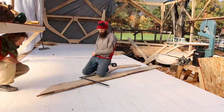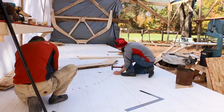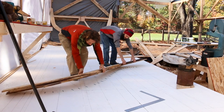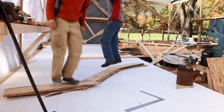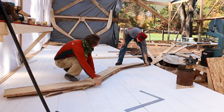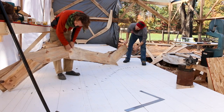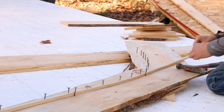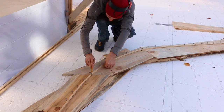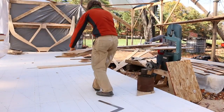There are many ways to construct the mold, but a solid lamination glued and screwed together worked well for us. Be sure to leave enough material inside of your line once cut to have a sturdy mold. After having a solid construction, flip it and start hammering the heads of roofing nails along the line to be transferred — the same technique used to make patterns for the backbone timbers. A nail in each transfer mark will then allow you to spring a batten to mark your line. Use the stiffest batten that will take the curve; for sharper curves an old bandsaw blade worked really well. Then just cut it out!